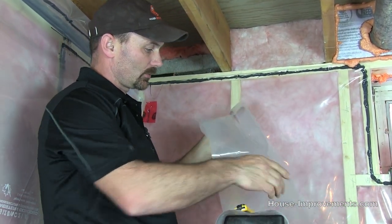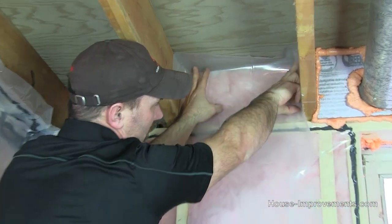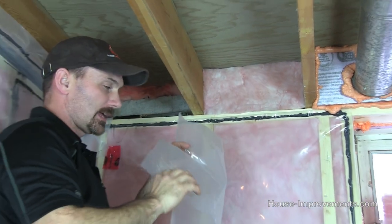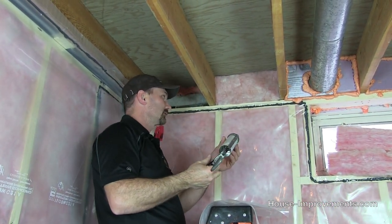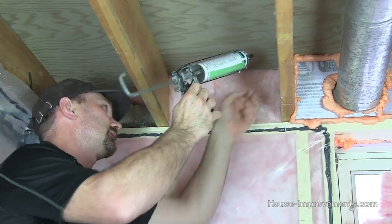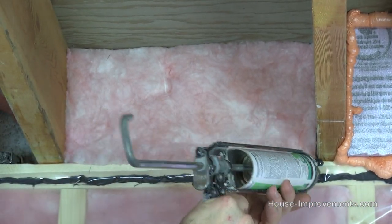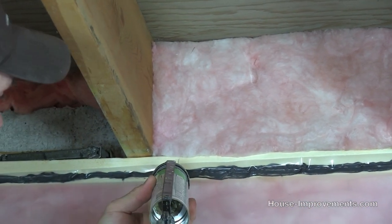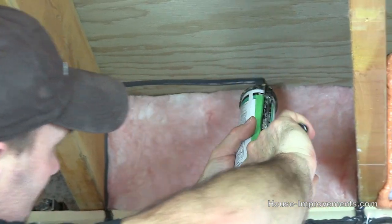We've got that insulated and we've got a square of the vapor barrier material cut — we want it a little bit wider and a little bit longer than the opening, as you can see. What we're going to do is run acoustical caulking all the way along all four sides of that, and then put this into there, seal it, and staple it in place. Acoustical caulking is really messy, so try not to get it on anything because it doesn't come off real well — that's one of the reasons I don't like using this method. We're just going to put a bead right along there and right down onto this other poly. You probably can't see it but I am putting a bead along there — it's not showing up because of the other acoustical caulking right underneath it. So back up this way, up that side, and across the top.